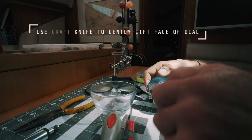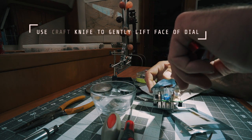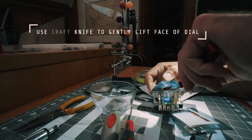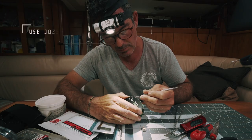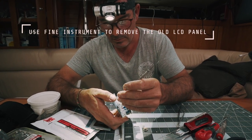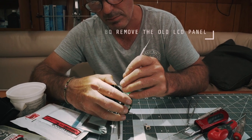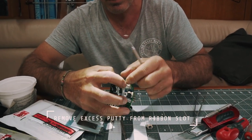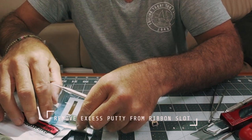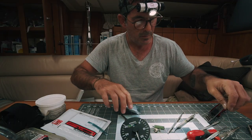The next step is to access the old LCD panel. To do this, lift the printed face of the rev counter away from the body of the instrument using the tip of a craft knife. You do not need to remove the face completely — just lift it sufficiently to gain access to the old LCD engine hour meter. Removing the old LCD was pretty straightforward: it is held in place by contact adhesive, but there is a small gap at the back of the instrument panel where you can use a fine instrument — in this case a dental probe — to push through and apply pressure onto the back of the LCD to push it out. Once complete, offer up the old panel to the new one to confirm they are the same size, then clean away any excess putty that could hamper fitting the new LCD panel.